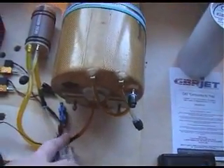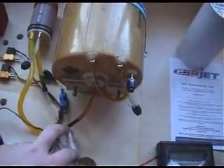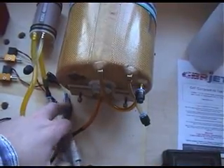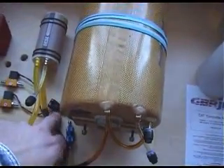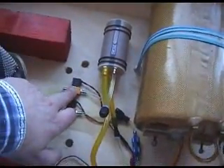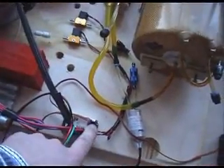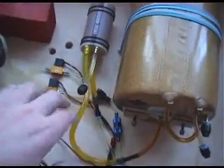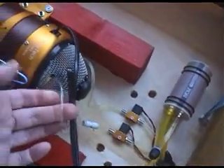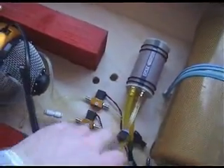Out of the fuel tank and the air trap we go to a fuel pump here which draws the fuel through a filter. We don't want any particles in the fuel getting into the turbine and damaging it. We have a little FESTO Y component here which splits the fuel feed into two valves. The valves can be switched on and off by the ECU, which controls the turbine operation — the lower one during the start-up sequence for the fuel line going to the top of the engine, and the main fuel line from the top valve.